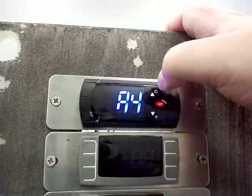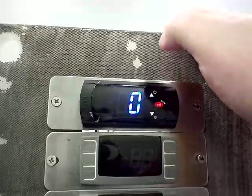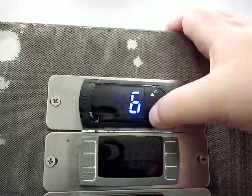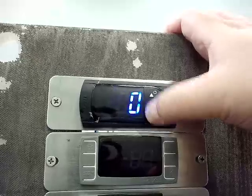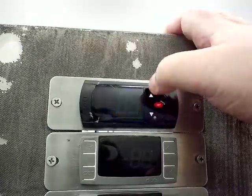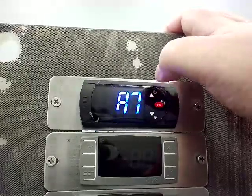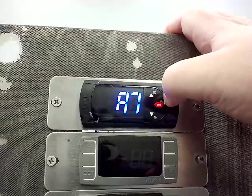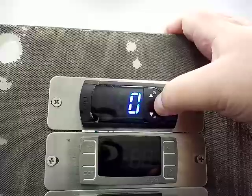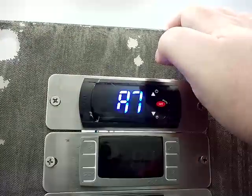A4 is the door switch control. This is normally set to 6 for our magnet door switch units, or 0 for the older white door switch style units. We're going to leave this on zero for now, treating it as having a white door switch. A7 is your digital alarm input delay, normally set to zero — basically the same kind of delay as above, dealing with the alarms.